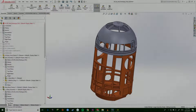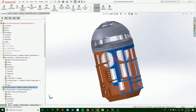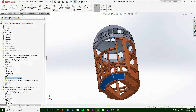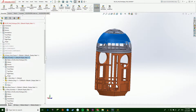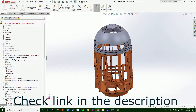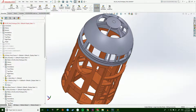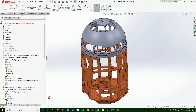Let's go ahead and swap over to this model. I'm going to show you today the basic frame structure I put together for both the body and the head. So this is the dome and the body frame assembly for R2. I have it divided up into four distinct parts: the front frame assembly, the rear frame assembly, the skirt assembly down below, and the dome assembly, which is basically the head. For this frame structure design, I went to astromech.net, which is the R2 Builders website, where they have blueprints for all different types of R2 units. I took those values and created a one-inch structural frame for the robot, so I'll be able to create relatively straightforward models to 3D print and a really structurally sound piece.